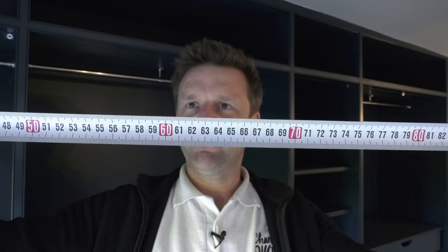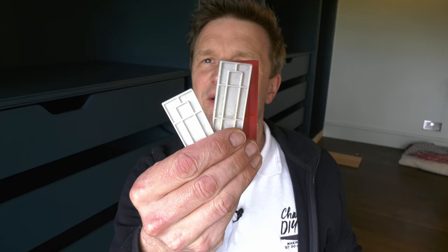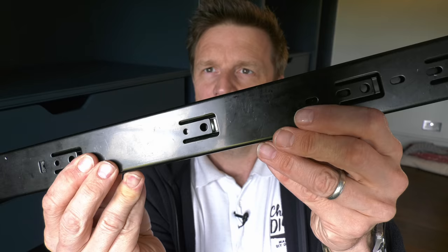The first job was to dig out the filler hiding the screws that attach these frames to the wardrobe so that I could remove them and plane them down a couple of millimeters with my electric planer. What I do suggest you do, if you're worried about getting your drawers to fit, is to make them if anything a little bit narrower rather than wider, because you can always pack them out with washers or glazing packers. And as somebody kindly pointed out, these particular runners have tabs on the back that you could bend out to adjust your drawers to the correct width.